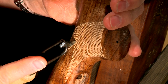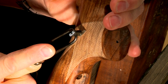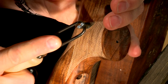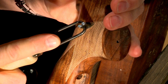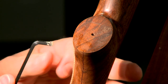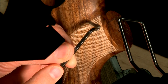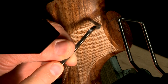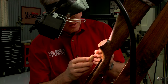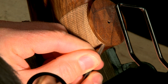Once all of the lines in the pattern are laid out, they need to be deepened. The first pass is made with the 60-degree cutter — its sharp cutting angle easily follows the layout lines. When I get close to the border, I switch to a 60-degree short cutter and use the hook and pull method to keep from cutting outside the pattern. The lines that are too short for the short cutter are deepened with the 60-degree veiner.